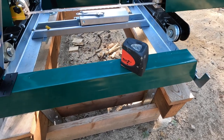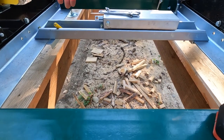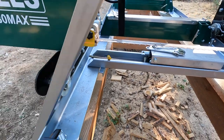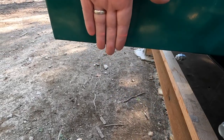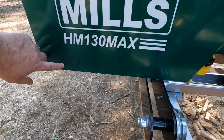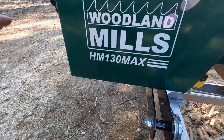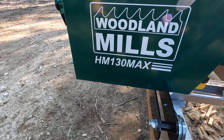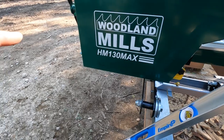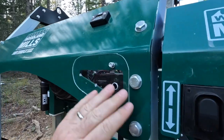The laser isn't working that well — maybe it's the new batteries. Basically I line that laser up against the blade. You can see it pretty well there in the yellow; it just didn't show up very well on the green surface. I do have a reference point there, and that bracket has some give to it so it doesn't have to be perfect. I'm trying to get it as close as I can — that's how I set up the bracket placement.